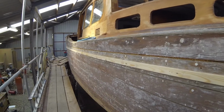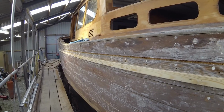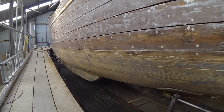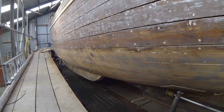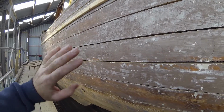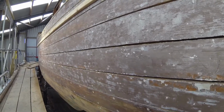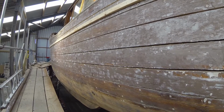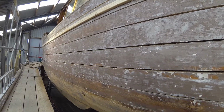So for the first 8 seams or so, we're going to have basically a close seamed hull, and then below the waterline we're going to leave it caulked in the usual fashion, just for maintenance, leak prevention and things like that. The idea is to make all these seams good with a glued batten, which is softer than this pitch pine, so there is a little bit of spring to it. And then that'll all get painted and sanded and faired in to finish.